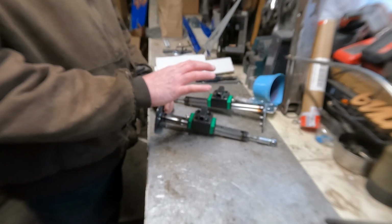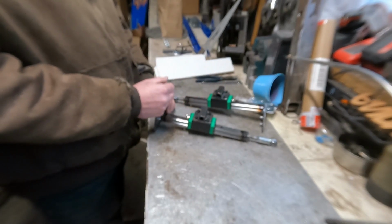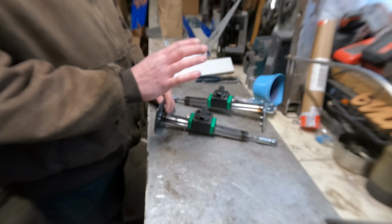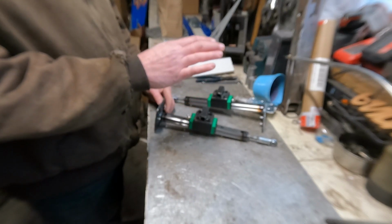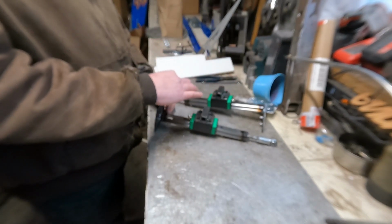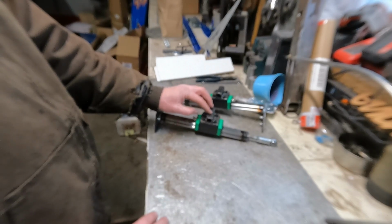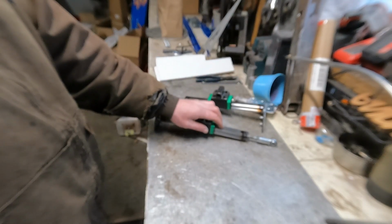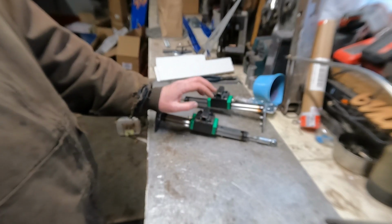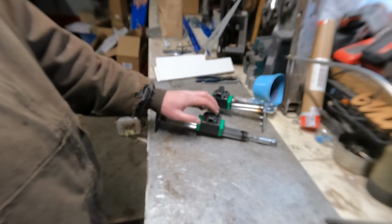With the clamp on pedals, they're always twisting. You're pushing down on them, they're not entirely safe. If you have to panic stop and you have to push down on that pedal and push hard to get a vehicle to stop, there's a very good chance that it'll either bend, pop off of the pedal. It just isn't a good design at all. So I told him, let me build a set of pedals for you, and let me see if I can get a truer pedal motion for you, so it'll help you enjoy your vehicles more, enjoy driving more, and be safer overall.